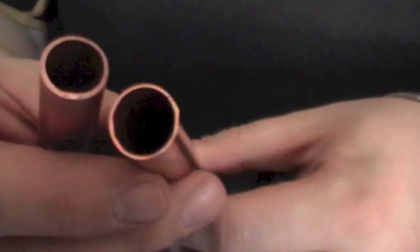As you can see, it's already cutting through. Just keep tightening the cutting wheel if need be — we're getting there already. The nice thing about these rather than a hacksaw blade is that you're going to have a lovely even cut for joining the pipe. There we go — smooth, and lovely and smooth on the cut side as well, and nice and even.